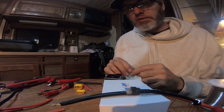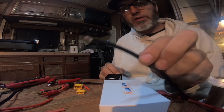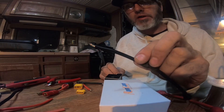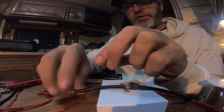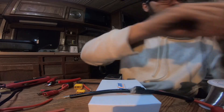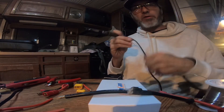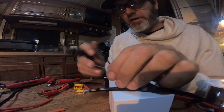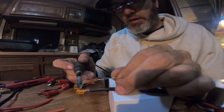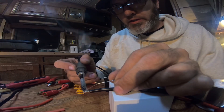Okay, Jason Fousey, this might not help because this is big 12-gauge wire — actually 10-gauge wire — and you're gonna have small stuff to solder, but maybe after I do this plug I'll find something small. Anyway, always use the metal solder and iron cleaner, and put solder on the tip right before you put it to anything.